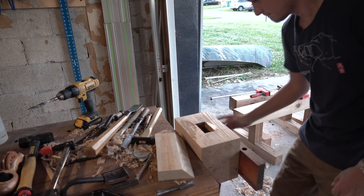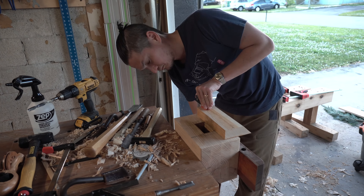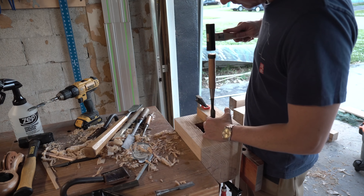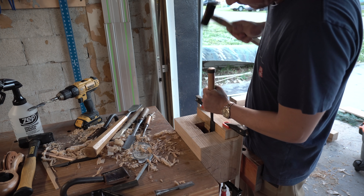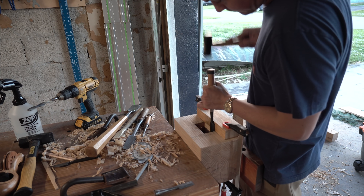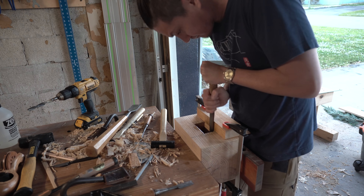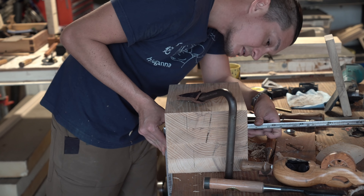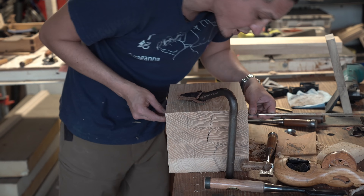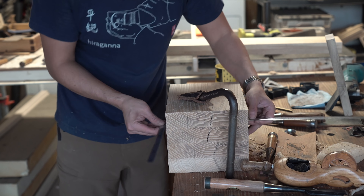Back on a more educational note, a big joinery principle that I was taught and continue to preach is that end grain should be severed before moving to cross grain material. Number one it makes removal of the cross grain material easier, but secondly it allows for cleaner corners and smoother cross grain walls. I like to use jigs from scrap wood to maintain angles. As you can see here when I'm checking for square, it takes a lot of the guesswork out on figuring whether you're going to be square across the interior of your mortise.